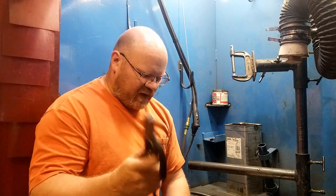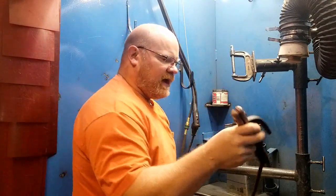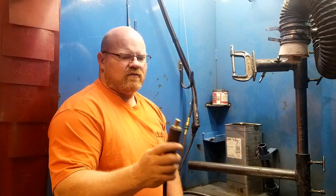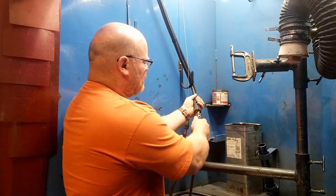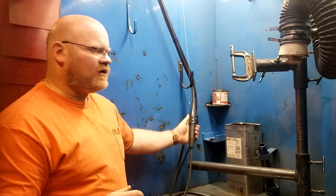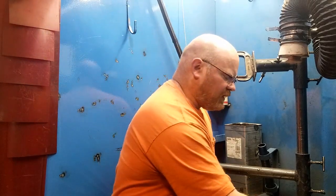On the other end, we're going to inspect this. Please don't drop these on the floor. I'm going to uncoil the stinger and hang it up someplace safe — I'll set it off on the right hand side of the booth. Then we're simply going to connect this cam lock. Make sure everything is secure, make sure things are tight, make sure the lugs are in good condition. Insert this in and then twist it — make sure it's tight. Don't just plug it in and turn it a little bit; all the welding current has to go through that. The ground is permanently hooked up. We've disconnected the power lead from the wire feeder and connected it to the stinger. For all practical intents and purposes, we're ready to stick weld. The only thing we have to do now is turn on the power and make sure that we're in the correct mode.